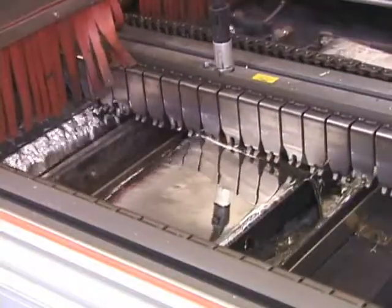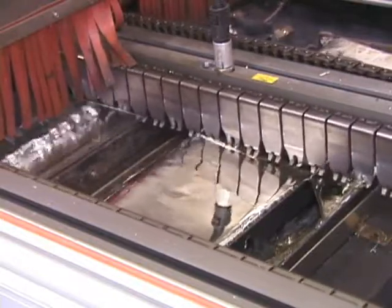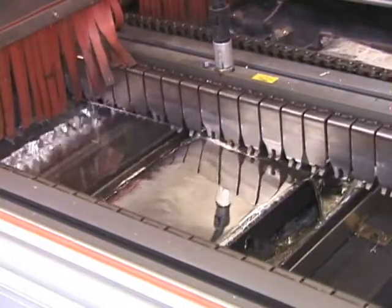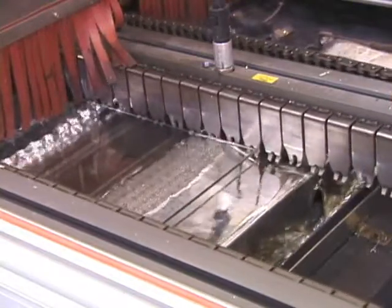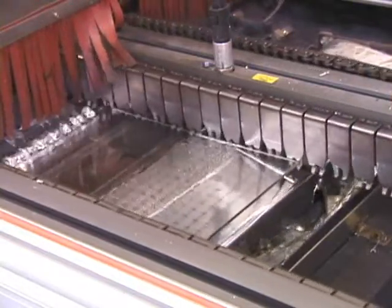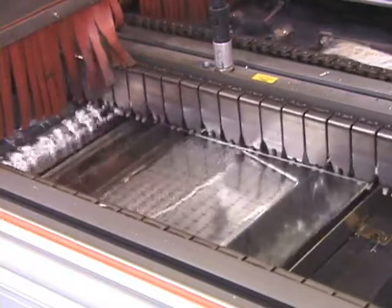Finally, we run the glass plate over the waves. The rotary chip wave should have around a half to one inch contact, and the main wave an inch and a half to three inch contact. Wave contact requirements may differ based upon the board and nozzle requirements.